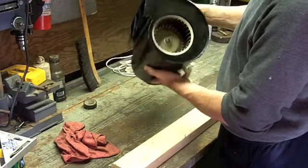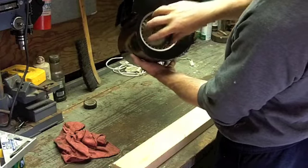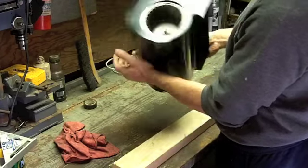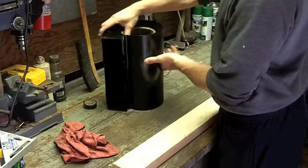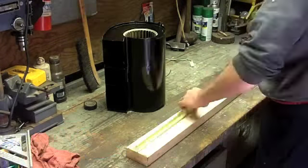They work well, you know. And then when these fins get clogged up in dust, you just get an Allen screw, you slide the squirrel cage out, you wash it, you put it all back together, and you got a good old fan again. So let me close my mouth and let me show you what's going to transpire here.